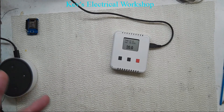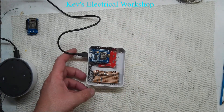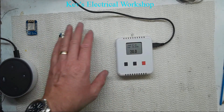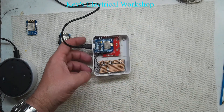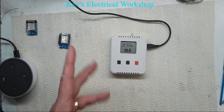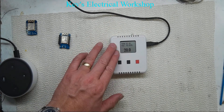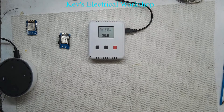I don't know where I'm going to go next on the project. Like I said, I'll be putting relays in — actually what I'll probably do is a relay module here so this controls that remotely over my local Wi-Fi. I'd also like to get a battery in here, so I may need to look into power saving and see how long you can get battery life out of one of these modules. I don't think the display is going to take much, but the Wi-Fi part may be quite current-sucking.